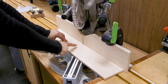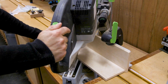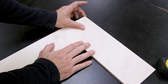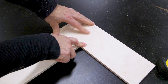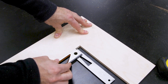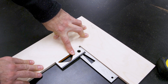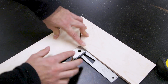We'll just make one simple cut. Now if I take these two pieces and turn one over so we can make a 90-degree corner, we can check the amount of error based on how they come together. We don't need to think about the 45 as much as we think about the 90 here. Making contact at the base, I am not making contact over here — so something is definitely off.